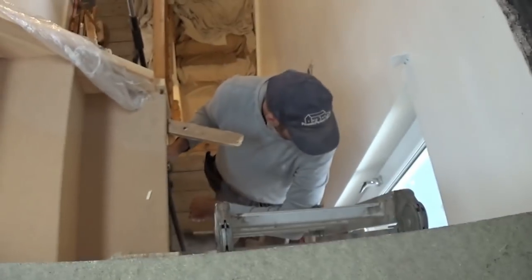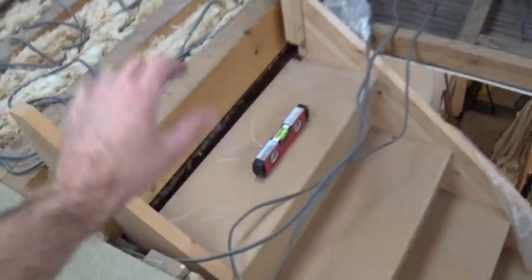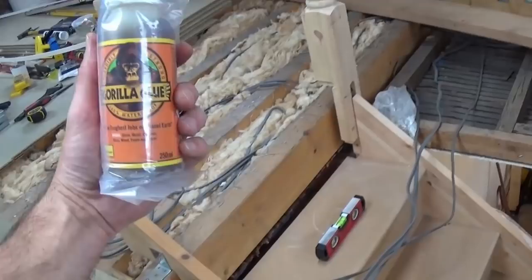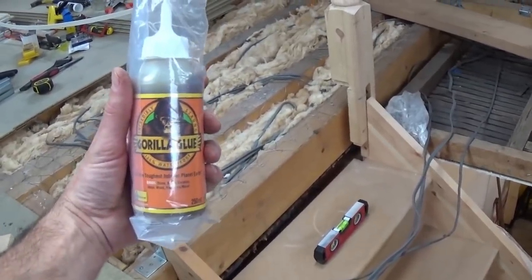So the next morning we're back. Big Pace is down here giving the orders — say good morning, everybody. We've been doing a bit of measuring up and fiddling around again. Basically we're going to pull these stairs up, try and attach the post in place, put the risers and treads on with some glue. We're using Gorilla Glue today — it slightly expands, which helps stop any creaks and fits it all together nicely. So we'll get it up, fit it together, and start working our way back down the stairs.